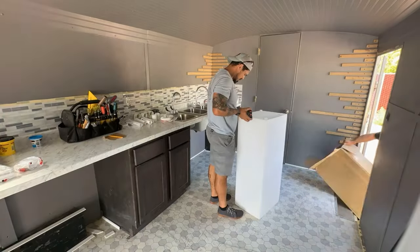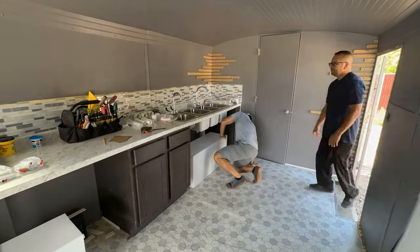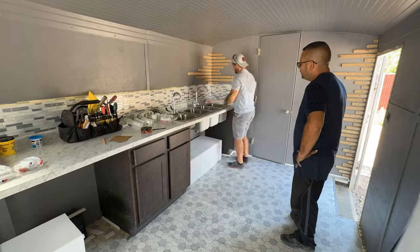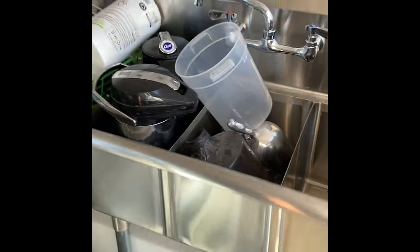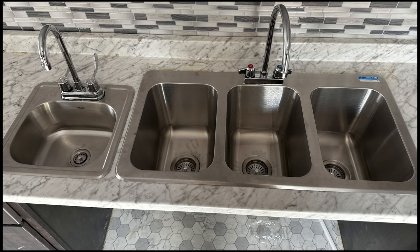Next, let's talk about where in the coffee truck we're going to put our piping and tanks. This depends on the layout of the trailer — most likely you're going to put things towards the nose. It also depends on whether or not you need integrated drain boards, like folks in California, versus those who do not. You'll have to see your code and regulations to determine that. Let's talk about some pros and cons of a standalone sink versus a sink you drop into your counter.